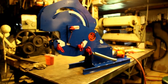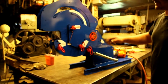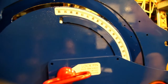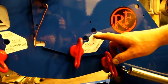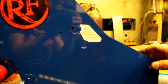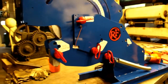We're back in the shop finishing up this Rogue Fab tubing bender. I had some blue paint left over from a project so I put some blue on here, then we assembled everything this morning. We got our decals on here, we've got our degree sticker on there, and these stickers make it helpful so you know where to put your different pressure dies — three and a half, four and a half, six inch centerline radius. And because this is the HD model, you could put an additional die back here. I'm going to cut a piece of tubing now and we'll make a test bend and see just what it does.